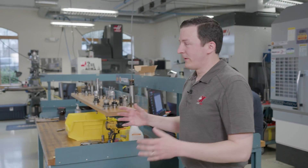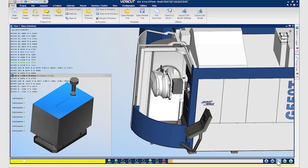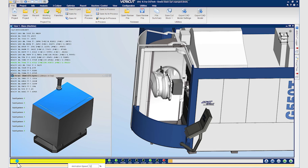We're here today in the Mastercam manufacturing lab talking about G-code simulation with VeriCut. If you're not familiar with G-code simulation, what that refers to is basically taking the NC file as posted from Mastercam, running it through VeriCut before you put it inside your CNC machine. This is going to find any problems you may have with your post processor or some crazy complicated multi-axis links.